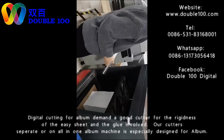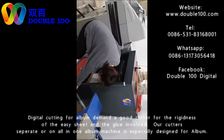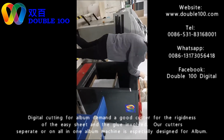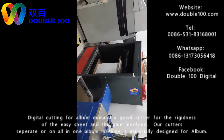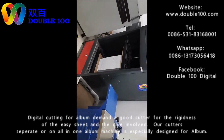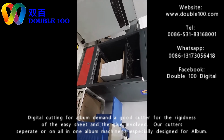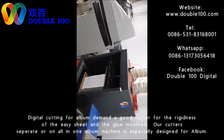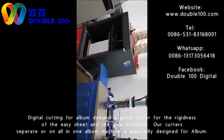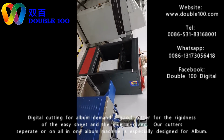The next step is pressing. We have many different pressing machines. If we use hot melt sheets, we use hot pressing. If we use cold adhesive sheets, we use cold pressing. This machine is cold pressing. You can see we press many books at one time. Adhesive sheets have a characteristic that the longer the pressing time, the better the effect. So this is a machine for cold pressing.